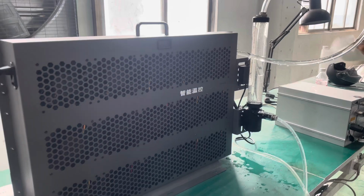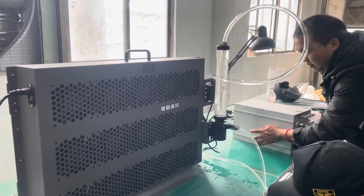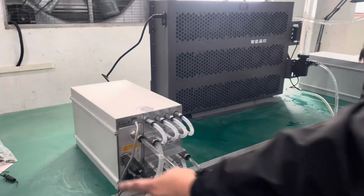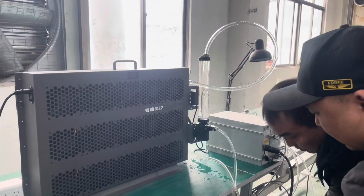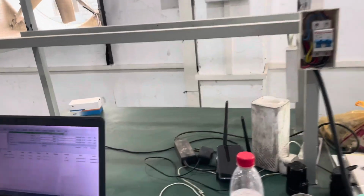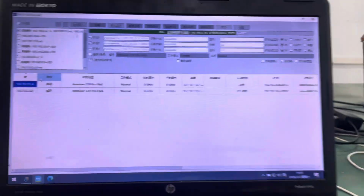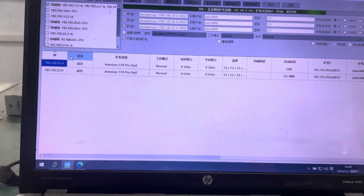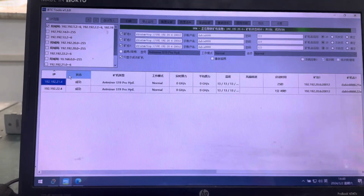So we refill the dry cooler with, say, not hot water but warm water, and we try to start the machines right now before running anything, so at least the miners get to start. And once the miners are up and running, generating hash rate, they will generate heat as well, and the fluid will stay on target temperature.